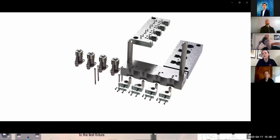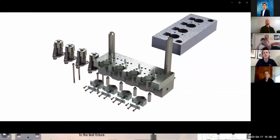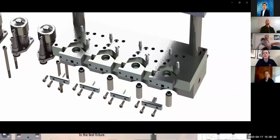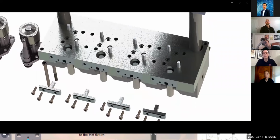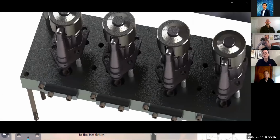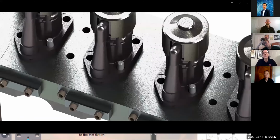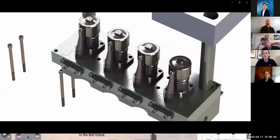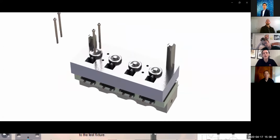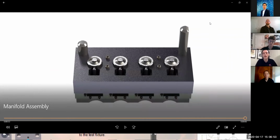And then if you need a different bottom plate, you could go ahead and reinsert the bottom plate back onto the manifold. Then your top plate will slide back in place. Your electrical connectors will also slot back in place. And then your solenoids are ready to be back in service, and they get slotted back into place as well. And then we're going to see basically back where we started, the top plate's going to slide down and the bolts are going to attach. And that would be your final assembled version of the solenoid mechanism.